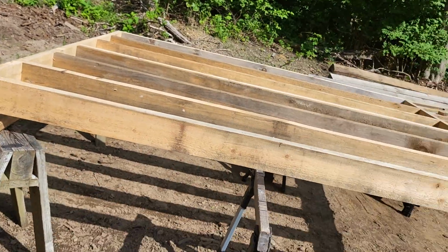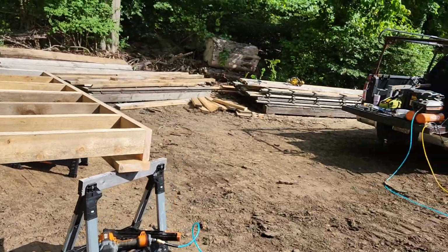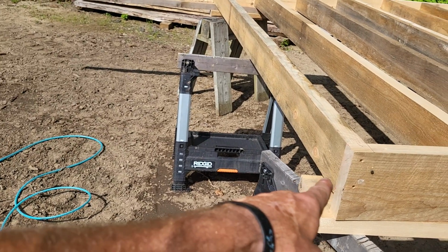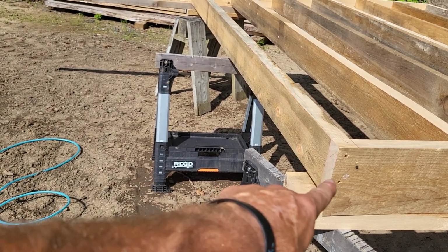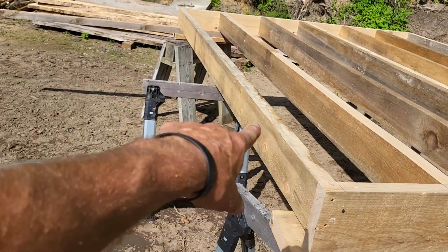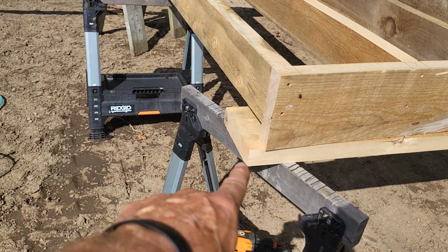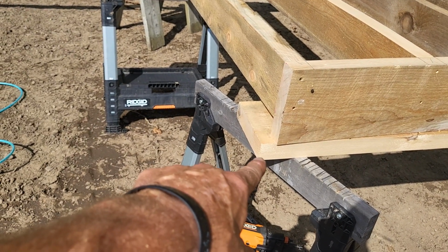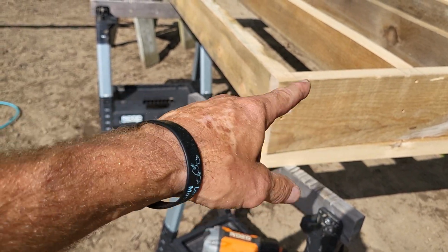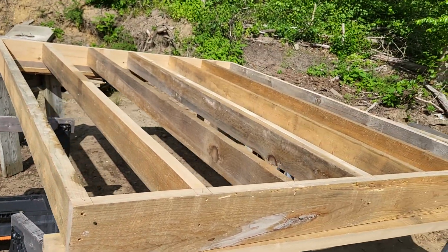So I'm gonna put one on that side, one on that side, a little sill plate underneath them so they can't fall down. And then I gotta cap the end. So I gotta cut a 2x8, that's the length from the outside of this to the outside of that, cap the end on both sides, shoot it into the edge joist. I have to shoot that joist together. And then these that are underneath right here are going to flip up and capture that outside and cap that. And then this part will be done.